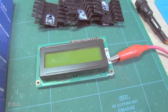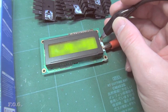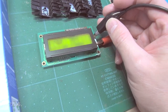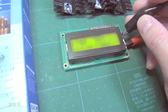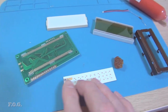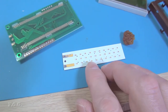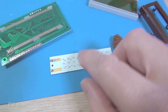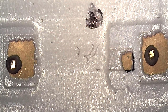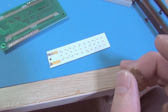The thing about these displays is that the backlight is dead. You can see it's patchy in its brightness—this is one of the better ones; it looks sort of bright on camera but in reality it's extremely dark and looks awful. I've dismantled one of these units—they have little metal tabs you can bend and pop off. The backlight board has small diodes directly embedded in it. This is a very old board, and clearly a lot of these diodes have died. There doesn't appear to be any resistor on there, so it must have required a lot of voltage.